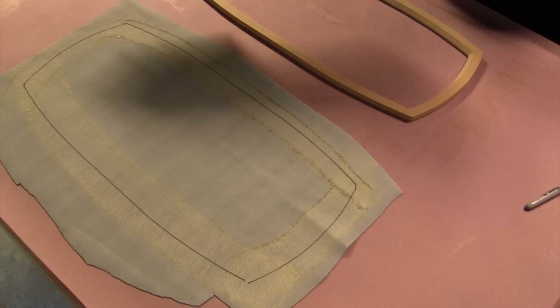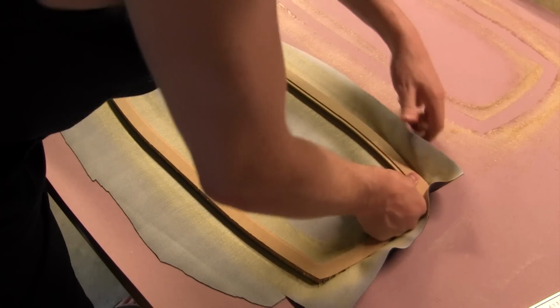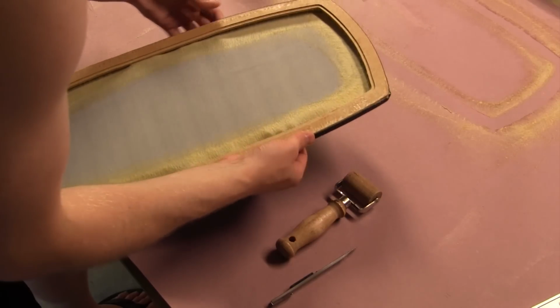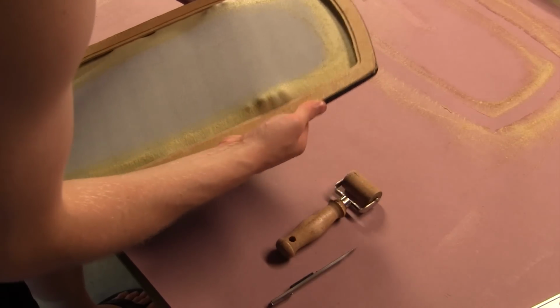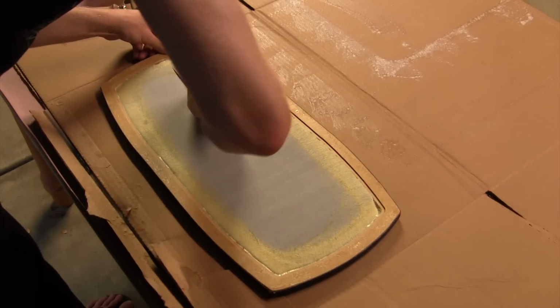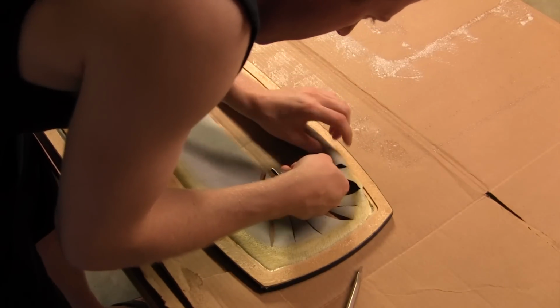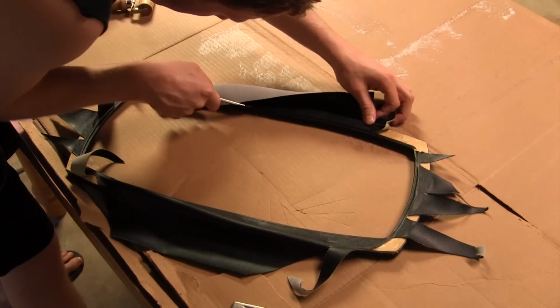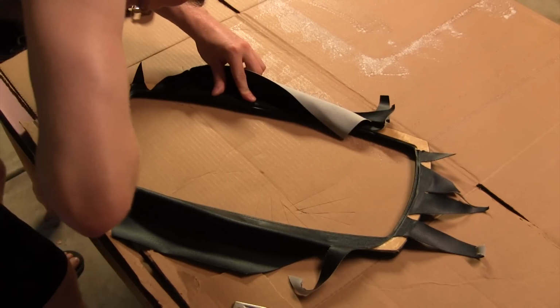The biggest thing I want to point out here is when you wrap the inside edge, you want to wrap the material around the back side of the piece. We can then use the little lip that we created earlier to cut the vinyl perfectly. The outside profile isn't as important as it press fits into the box, so the vinyl edge on the outside will be hidden.